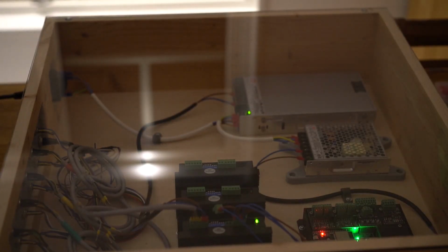So I've now figured out what the problem was. It wasn't in fact the microstepping, although I've left it at 2 microsteps per step now. The problem was the enable-disable connection. In my controller settings, I did not take into account that the enable signal is inverted. So it's actually enabled when there is no voltage on those pins. And it says in the user manual as well that this is usually just simply left unconnected. So always enabled. I figured, why not?